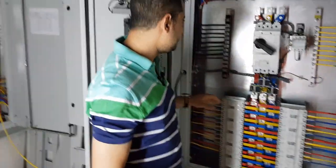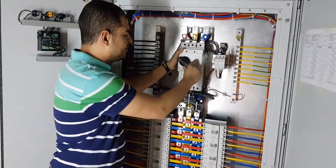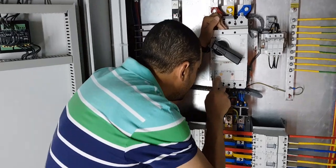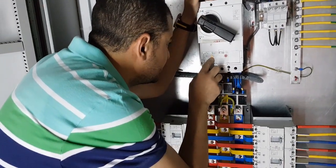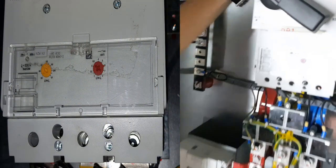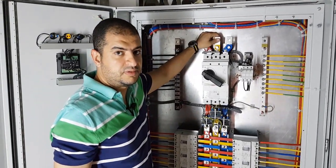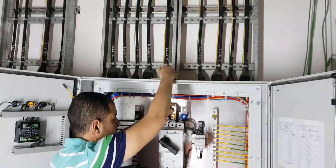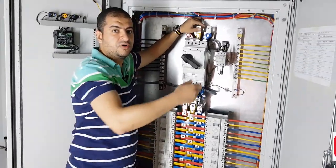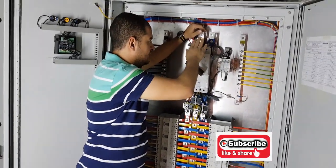Here is the main breaker from Atom — its frame rating is 630 amperes, and it can be adjusted as you can see. This is the main part of the breaker for the incomer. The cable will come as a top entry and be connected here, but actually this panel should have more space above the breaker to allow bending the cable and keeping spare cable inside the panel. This is actually a problem here.